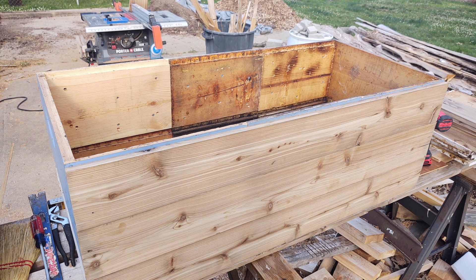The offset exterior boards help to stack the boxes neatly — they just kind of fit over each other and hold everything in place. It also seals against weather; any rain will run down those outer boards rather than seeping through the joints. Had I lined those boards up flush with the edge, there's more of a chance that water could have gotten in.